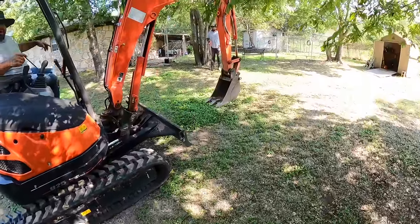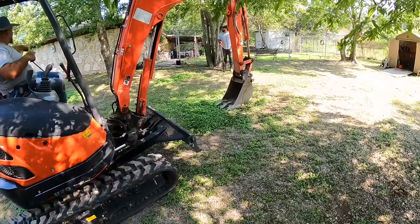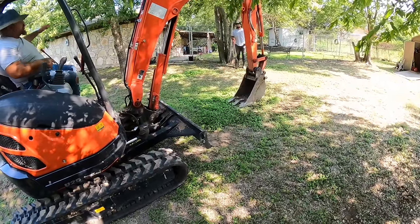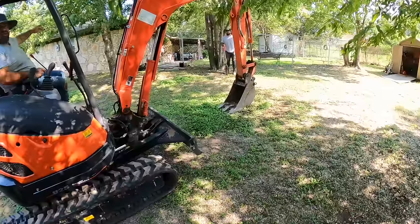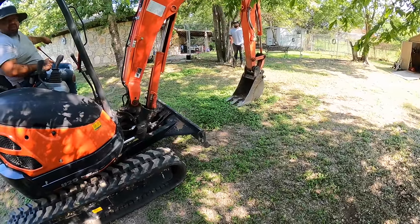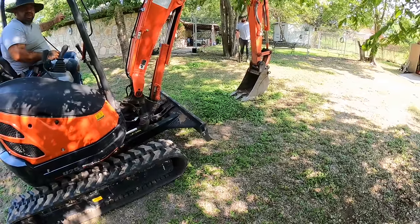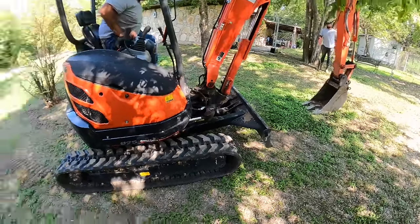Okay. In the locator, and we'll see which way the pipe is coming out. There's a restroom here, but there's no clean out over here. It's all the way to the other side of the house. So once it comes over here, if we can locate it, we can put a clean out. Because right now, the clean out's all the way to the other side of the house, so it's no good over here. Right. All right.